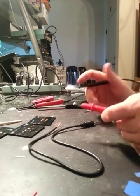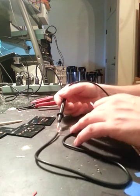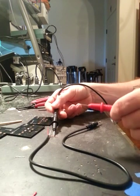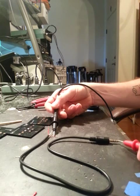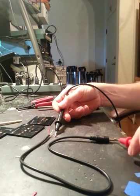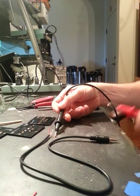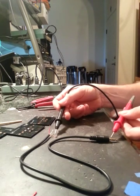So now I'm going to find the easiest one — the common ground. I'm going to attach my lead to the big copper braid and then go along here. The tip is not this wire because I'm not getting any sound; it's not conducting. The middle part is not the wire either. The big part in the back — that big chunk right there — is the common ground.